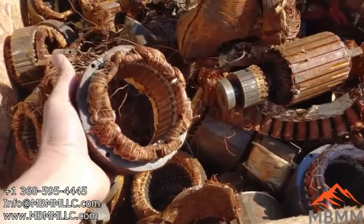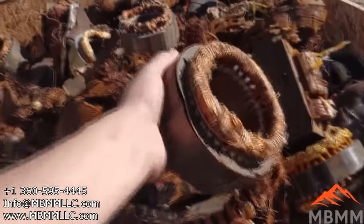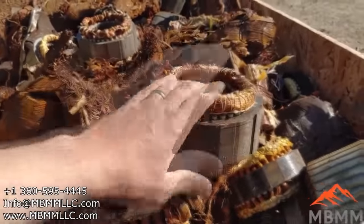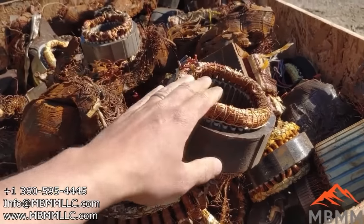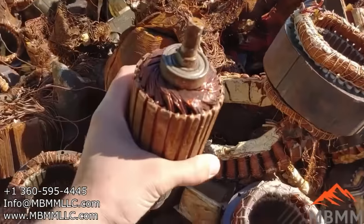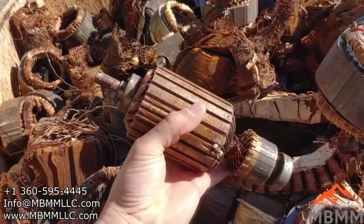Almost all the stuff we can run. The limits on the machine that we set are anything under 20 pounds. A stator like this breaks up pretty easy because it's just a bunch of plates glued together. But anything under 20 pounds, and anything with a shaft or a solid metal piece in there has to be less than a half inch.